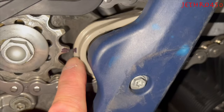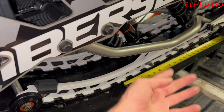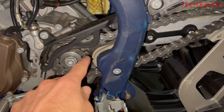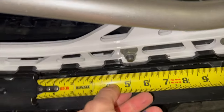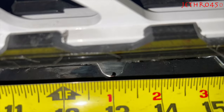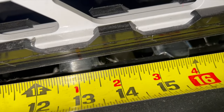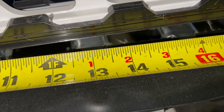You do that by placing a mark on your sprocket and placing a mark down here on your kit. Then you push the track around in a circle until your sprocket has gone one full revolution, and then you measure where that mark went. There is the original mark and there's where I marked the track — we're about 13 and an eighth.